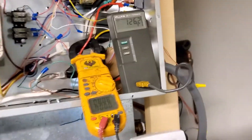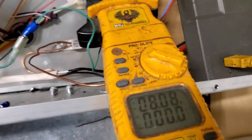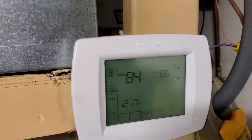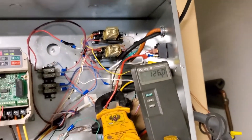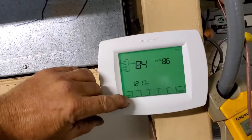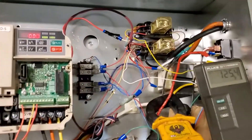The amps were right around 10 amps at 60 Hz with fast blower, and when it drops to 50 Hz and slows the blower it goes down to about 8 amps. It just shut off — just got a little over 120. I'll leave it set at 86 even though it says 84; I think it's looking at the heat rise. I'm going to leave it right there for now — I think that'll control it temporarily. I'll put the blower on auto because it doesn't need to run all the time. Pretty cool.